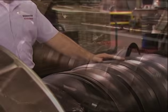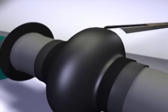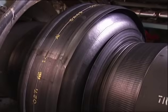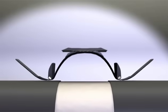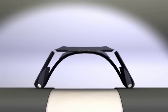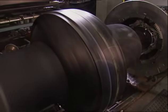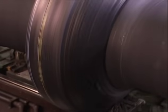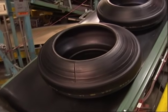It still doesn't look much like a tire, but that's where the magic of the tire assembly machine comes in. A bladder inside the new tire is inflated, then the belts are put into place, and finally the tread is attached. Bladders on each side inflate, pushing components into the characteristic tire shape. The sidewalls and body ply ends are folded around the beads and pressed firmly against the sides of the tire. A barcode is applied identifying this tire, the operator who built it, and every component in it, so any irregularity can be tracked back to its source. Special rollers press all components together in a process called stitching. Because the rubber is still uncured, the parts are soft and stick together easily, resulting in what we call a green tire.